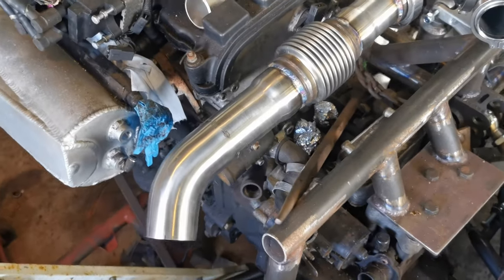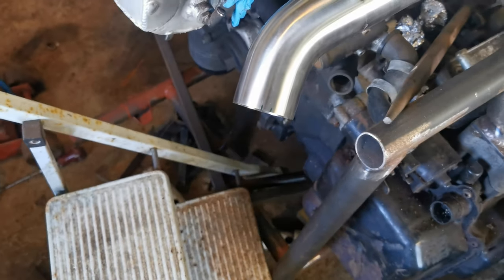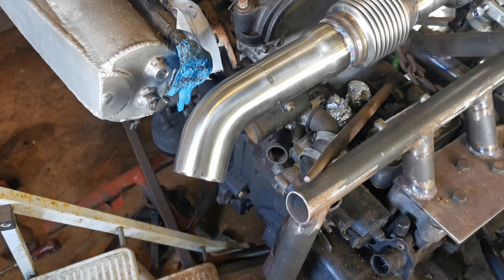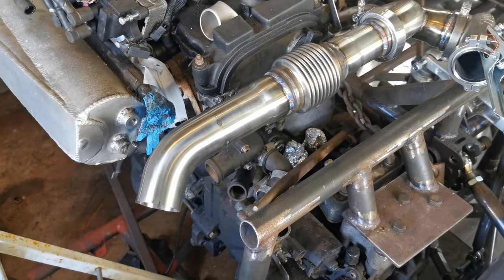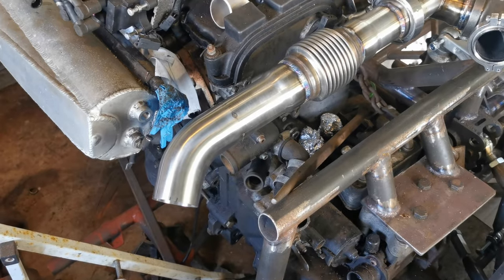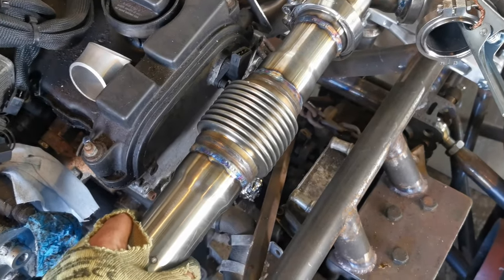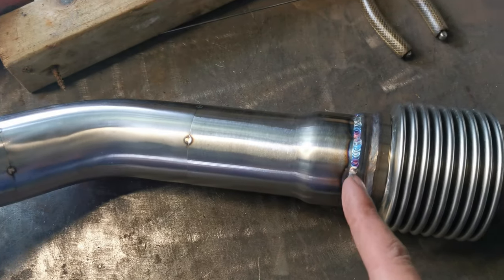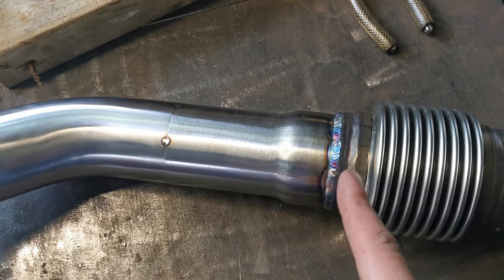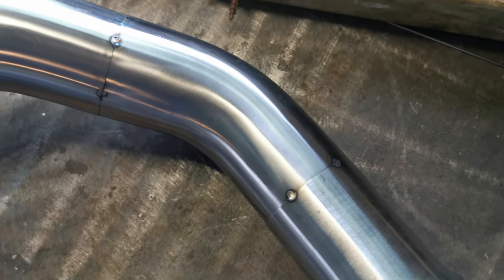One thing I try to do is make the least amount of cuts that I can. When you buy bends — I don't know what they use to cut these, laser or water jet maybe — they're perfectly flat. So if I can keep it like that, it makes it way easier to fit up. Unless you've got decent cutting equipment, which I certainly don't have. When I cut stuff it leaves little gaps and you've got to spend ages on it. These are all solid pipes — the only cut I've had to make, I've cut it down on the side that slips inside, so it doesn't really matter if it's straight. See how perfectly they're butted up — that's because I didn't cut them.